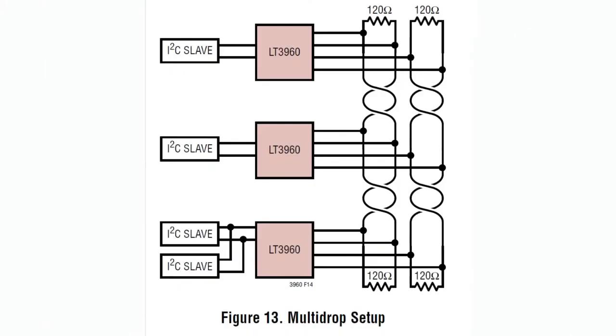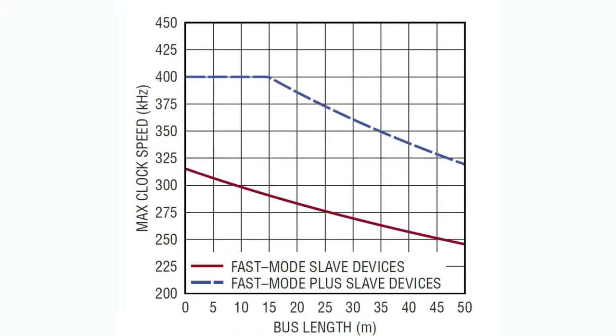Here's an example of a multi-drop setup. On the other side you'd have the controller, but you can have multiple I2C peripherals — either on one transceiver converter or multiple transceiver converters — terminated with a 120-ohm resistor, which is the standard CAN bus physical interface termination. They call it I2C-AN bus, or I2CAN. You can also go quite fast — 400 kilohertz is pretty common.